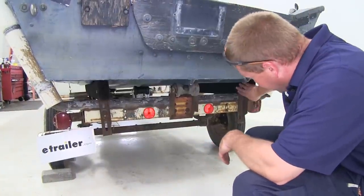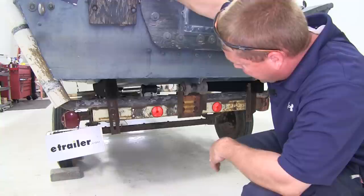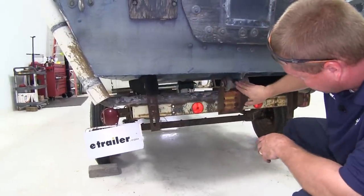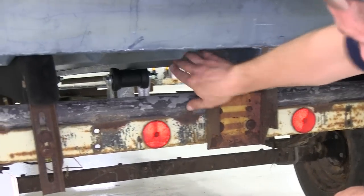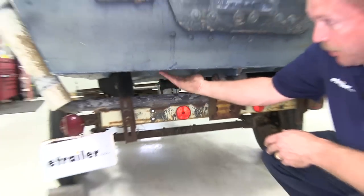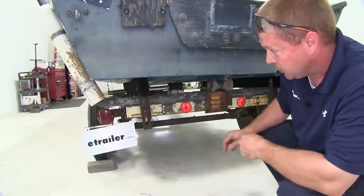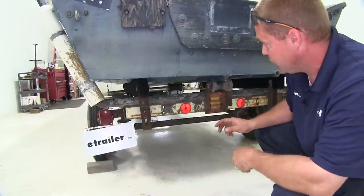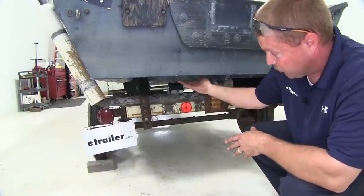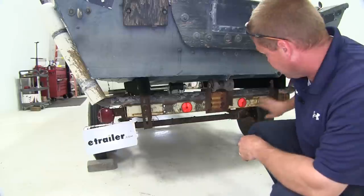Now as you can see, we've got both sides installed. The boat is actually sitting on both sides so it's not rocking back and forth anymore. Now we were able to slide these out because the boat was supported here by the center keel roller, as well as there's one a little farther up. Now if for some reason you didn't have that set up on your boat, you would definitely want to support the boat when you remove these, or ideally you can have the boat off the trailer and change the bunks out — it would be much easier. But if you don't have any other option, you can do it with the boat on the trailer still. Just make sure to support the boat properly, and then you can change out each side.